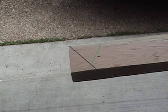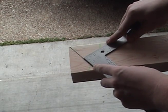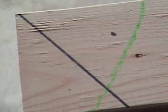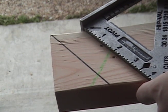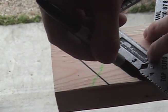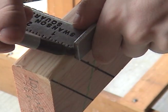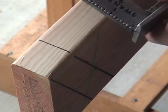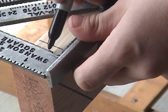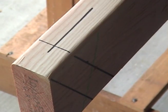Next, we measure from this plumb line one and one-sixteenth inches to the right to shorten it to adjust for the ridge board. You take a framing square or ruler and put it up against the line, then make a mark where the line is supposed to be. Then we take our speed square again, line up that same 11, and put it over the point we just made, and trace the line again. Next, we mark a straight line from where our second plumb line is, and then draw a line down the middle of the top edge. We take our speed square and there's a little groove on the three-quarter mark — we put our pencil on that groove and go down, giving us the center line for the top of our board.